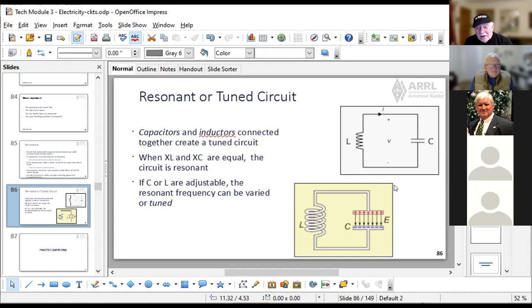And if I turn on my FM radio, I can find one station on six parts of the dial because the circuits are being overloaded. What some people have done is to make a circuit, especially a series circuit, that would allow a certain frequency to pass through. They attach it to the antenna and attach the other side to ground. So it lets the signal from the station that I don't like go directly to ground, and it doesn't have any effect on the stations or the frequencies of the stations that I want.